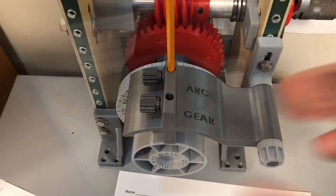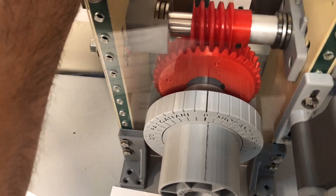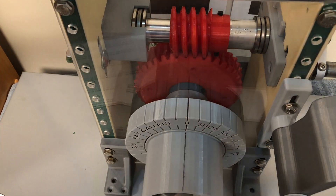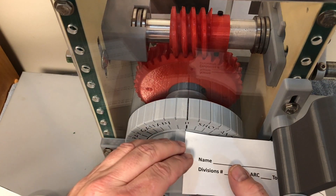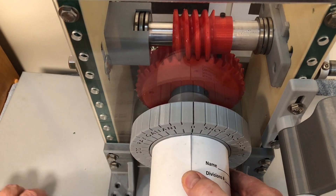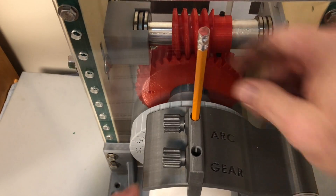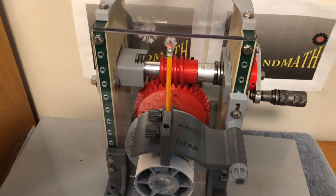Let's take a look at the machine. We rotate it back to the beginning — it's extremely light, weighs almost nothing. We have this zero line and we're going to start at zero. To mount the paper, take a piece of tape, line it up with the zero line, and wrap it around the barrel — it should meet pretty much perfectly. Take another piece of tape to secure it down. The back sheet is your arc and the front one is your gear. That is basically how this machine works.